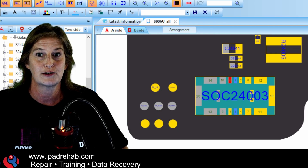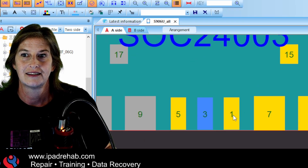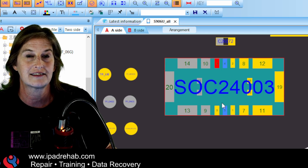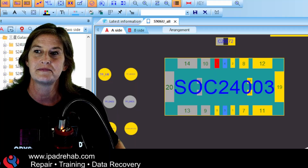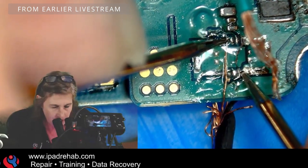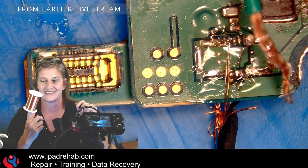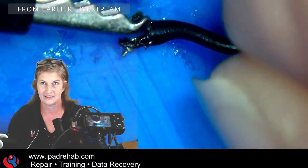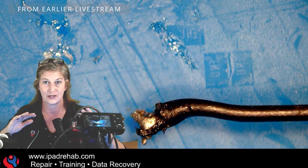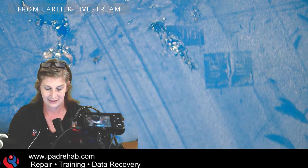So the next thing I did, I went ahead and soldered wires — one right here to the VBAT sense and the other one to the VBAT sense ground. I soldered a wire to each of these points and then connected them to my DC power supply. In continuity mode — no beep. Hooray! As soon as you connect through the thin wire, it's just instantly — pop. I just brought it over, touched it like that, and now I have zero current. Zero current means there's no short. I think it might have actually worked, which is pretty surprising.